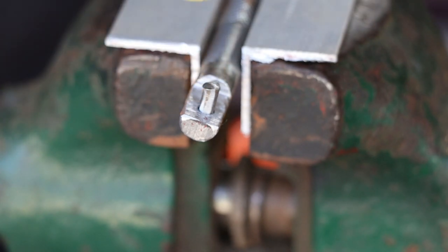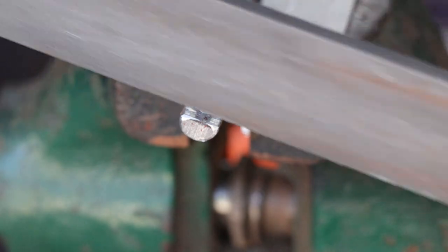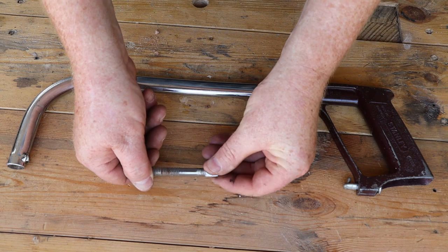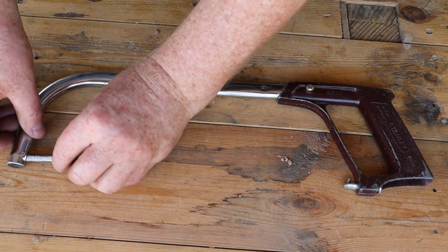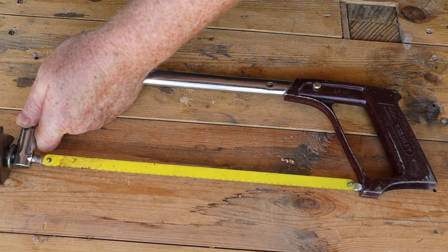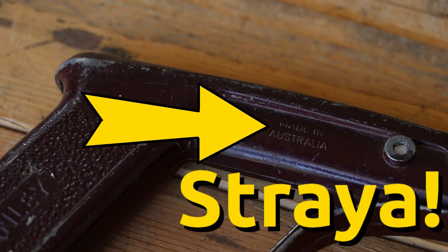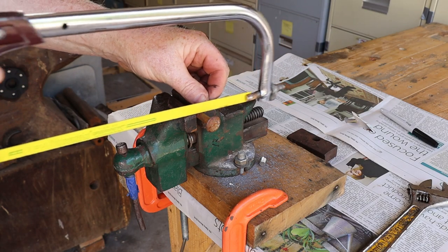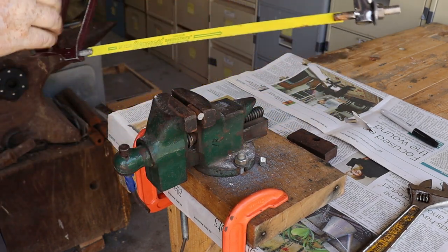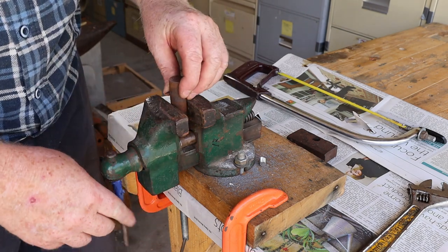Once the pin will fit, hammer it tightly into the hole then saw off the excess. Now we can use our ball-peen hammer to rivet over the other end of the pin — this will prevent the pin from falling out. Because we were holding this end of the pin against the vise while riveting it's now mushroomed and the hacksaw blade won't fit over it, but that's easily fixed with a few strokes of the file. So now we can assemble our hacksaw using the nut and washer that came with our donor bolt. We have to use a spanner to tighten the bolt but that's not a big deal. Let's try a test cut to see how it works.